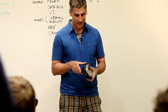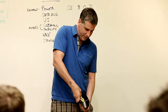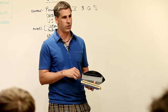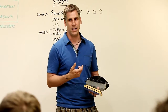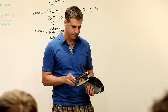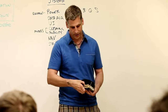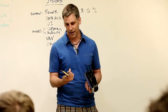What we ended up doing is figuring out the filter, because any time you have a vacuum, you need one. This one has a secret hidden compartment with the filter. Due to packaging constraints, we went with what's called a dirty vac, where you suck the debris through the impeller. We thought it would get jammed up, but it worked beautifully - never got jammed. We also made the squeegee separable so that as you pull out the filter, it separates the squeegee and all the debris falls right out.